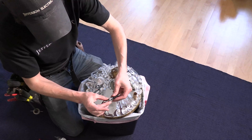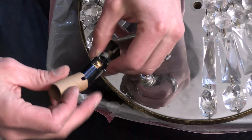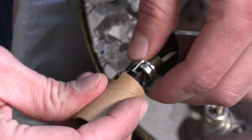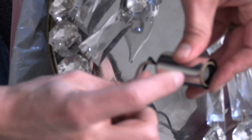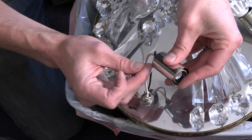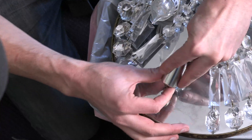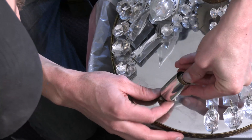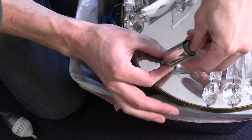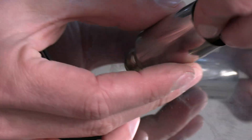I've got that lock washer — stacking my pieces here. Almost forgot my insulator; you've got to have that insulator to protect the terminals. There it is — that's looking good. It's a nice length match. That's the one thing to watch out for; I had options for longer sockets, so I actually took that measurement before ordering the replacement socket. Slide this through. And the last point of caution: as you're twisting this nipple back into place, make sure the wire's turning freely so it's not binding up anywhere, because wire in a bind will end up being a short.